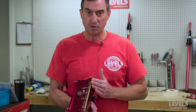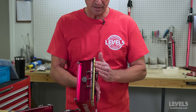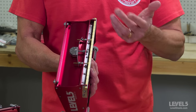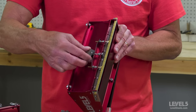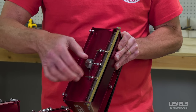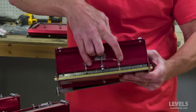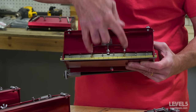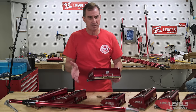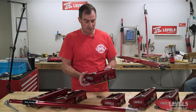You'll notice that we've got the same brass blade holder as anyone else has. You've got that in there with a bit of a curved feature there to give you your finish. We've got our adjustments, one through five, when you go from your fill coat to your skim coat. You've got your adjustments here on the front side of the box so that you can get more or less flex from your brass blade holder — very similar, if not exactly like every other box out there.